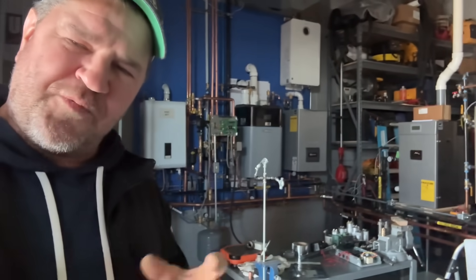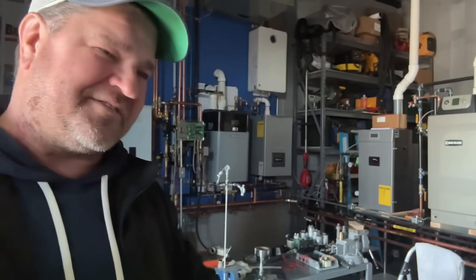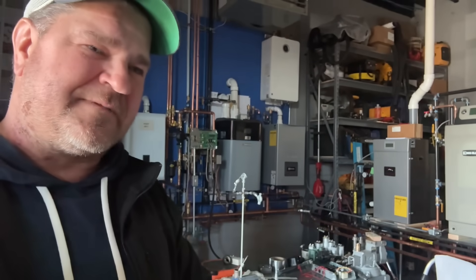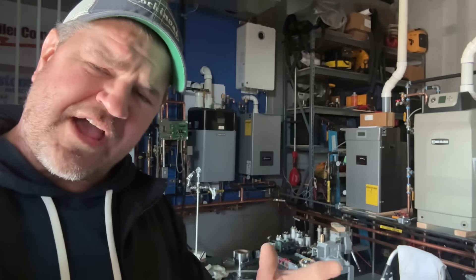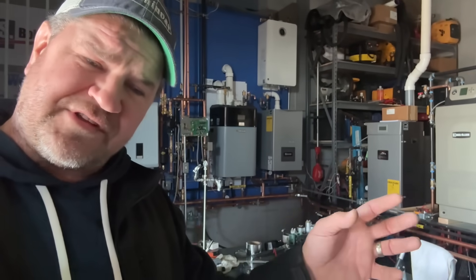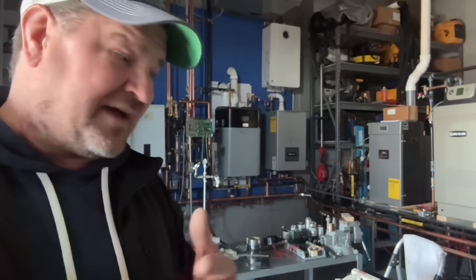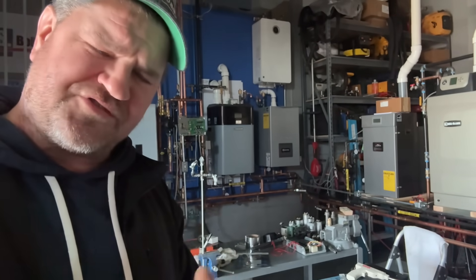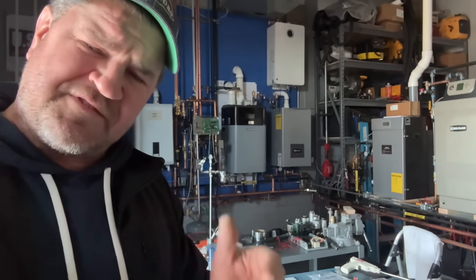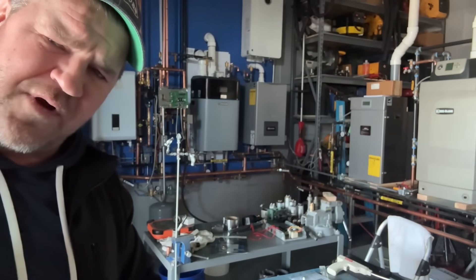Thank you so much for watching. If you were like the contractor who was at this job on Friday night pulling his hair out — didn't know if it was a bad low water cutoff or a bad transformer — if you run into a failed RB24 and the green light isn't on, check your power. Make sure you have the proper voltage coming in. If you do, do your due diligence and see if maybe there was a short that shorted out the original low water cutoff, because if you put a new one in it's going to die as well. We did an amperage test on the wiring to make sure nothing was funky and it was all within range. Do due diligence and you'll save yourself the aggravation and embarrassment of a recall — it's going to cost you time and money. Thank you so much for watching, guys. I'll catch you in the next one. Be well, God bless, stay safe.